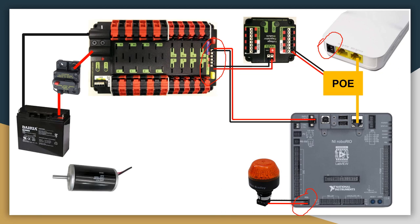Say we want to connect a motor to our robot. In order to drive the motor, we need a motor controller, and the motor controller gets its power from the ports along the PDP. In order to communicate with this controller — in this case a Talon motor controller — we connect the CAN bus starting from the RoboRio going to the motor controller. Generally, the CAN bus terminates on the PDP. However, sometimes, like our robot in 2020, the CAN bus can't really terminate on the PDP — in that case, we would just put a termination resistor on the end of the bus. And that does it for a basic wiring of the FRC control system. Thank you.